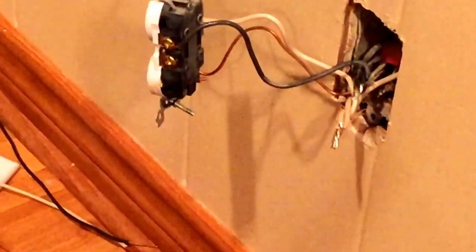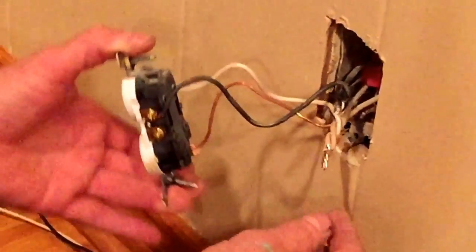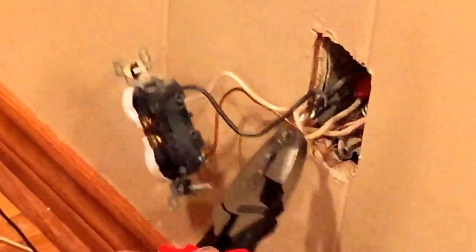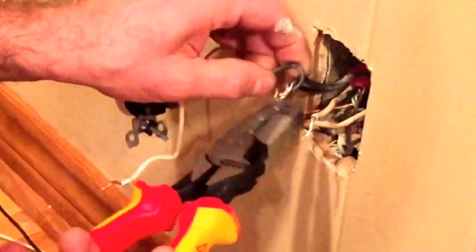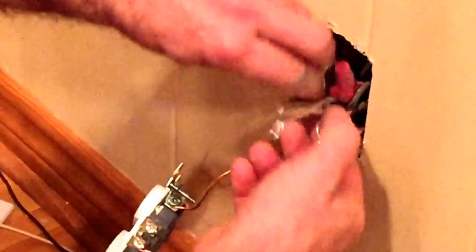I have tested it and turned off the circuit, so that's obviously the first thing you do. Here you have 12-gauge aluminum, which is rated at 15 amps, pigtailed onto 12-gauge copper. What we're going to do is use the Alumiconn connectors to make a correct pigtail. I'm using my pliers to undo the aluminum wiring. We're not going to use this outlet — we'll use a better version — and we're going to redo the ground as well.